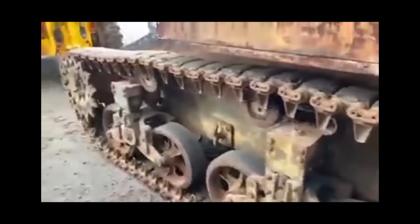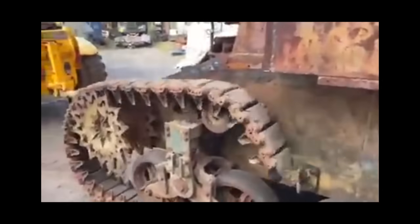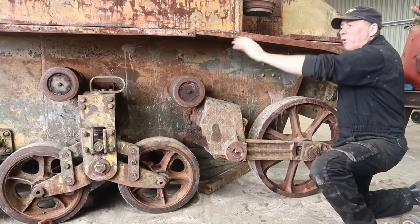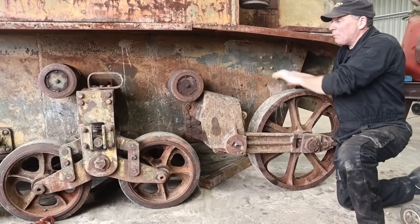I have one of the tracks split. My partner in crime disappeared an hour ago to run a crew for the tank battles, so it's a bit more difficult on your own. We have one more to take off. Assuming I don't have a heart attack, we should have these tracks off. Hopefully when Stu draws forward, the tracks are just going to roll off — onto that final top roller, onto the final drives, and there they both go. Brilliant. The tracks have been removed. They were really rough on the outside, but the underside that ran on the wheels is like new, so we're going to turn them sort of inside out and run on the good stuff.